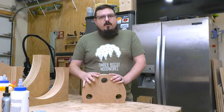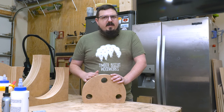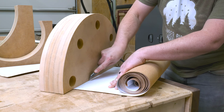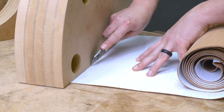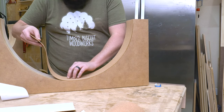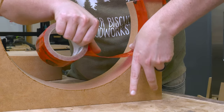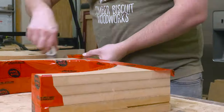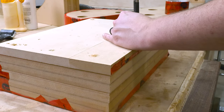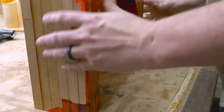At this point the molds are pretty close. I want to wrap the inside area with cork so it'll give a little and flex if there are any imperfections. I'm using adhesive-backed cork, but regular cork with spray adhesive works too. Next I wrapped the forms with tuck tape where they'd contact the glue — packing tape works just as well. To make sure the bottom of the mold was flat I attached a couple of scrap MDF pieces with screws so I could pop them out to remove the bent lamination if needed.